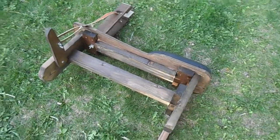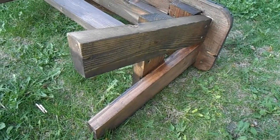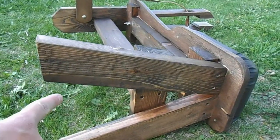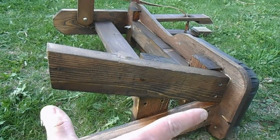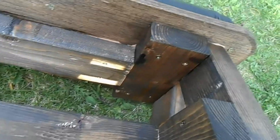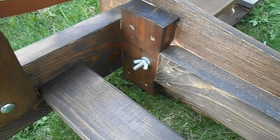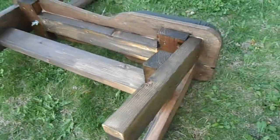This is more of a scrap wood project. I had some 2x4s laying around. It's basically just an A-frame leg on the back with 15-degree bevels on both ends, 16 inches tall. On the front I just took a piece of 2x6, same thing, 16 inches tall. Underneath the three-quarter inch piece of oak I've built a couple of 2x4s in for extra stability when you're sitting on it, and then there's a cross member across the bench itself.